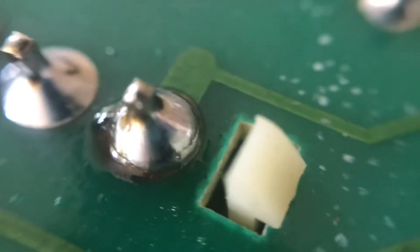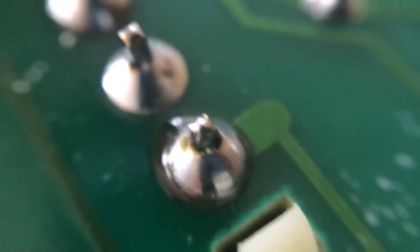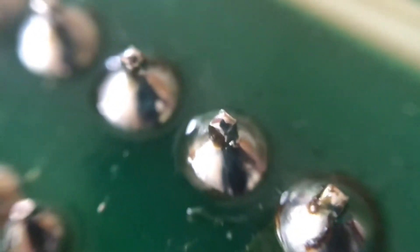This is how it looks after I soldered all of them. This was actually the bad one. I re-soldered all 10 just in case, because if I was losing power, the power should be lost from the very beginning of the supply, which is this component here. We'll see if that fixes it.